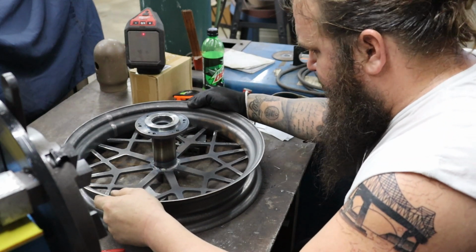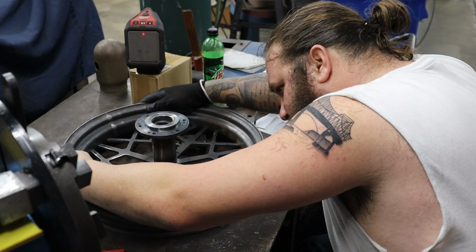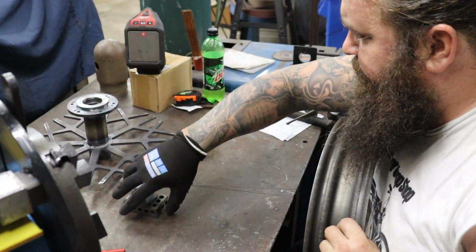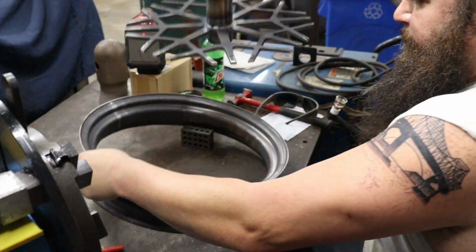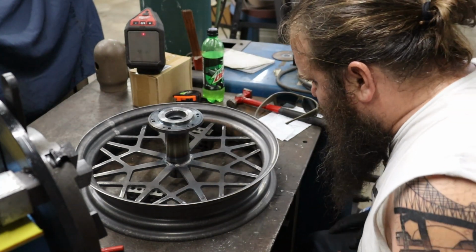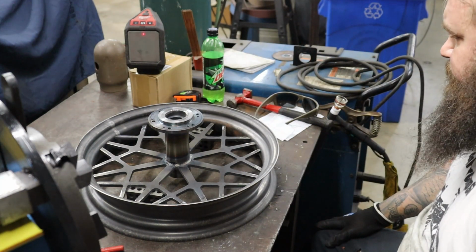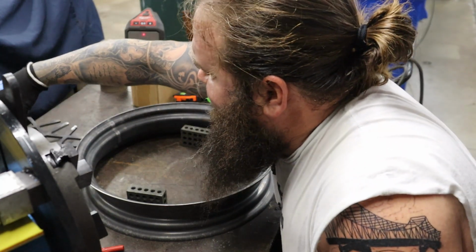And we're back on the table and working on locating our rim hoop correctly centered to our wheel center. Again, we got it sitting on some 1, 2, 3 blocks. This time I started out with 1, 2, 3 blocks with the 1/4-inch spacer that we used previously. That didn't work. It was too low. Flipped the 1, 2, 3 blocks to the 2-inch side. That was too high. So went over to our scrap bin, dug up some square bar. Started out with some 3/4-inch square bar, which I initially thought was going to work okay.